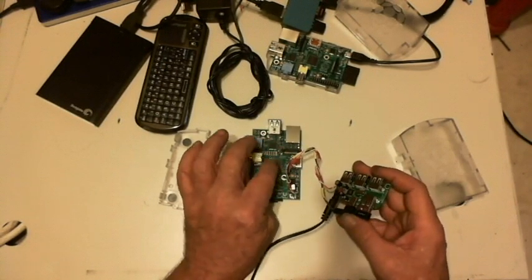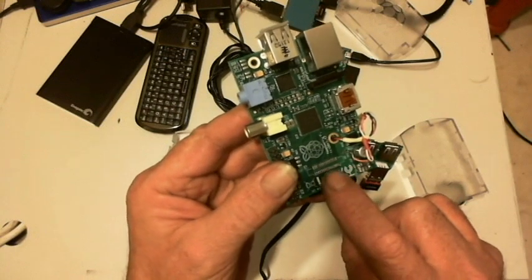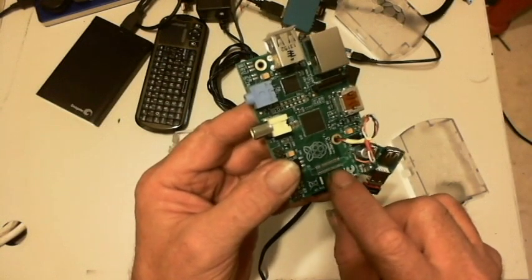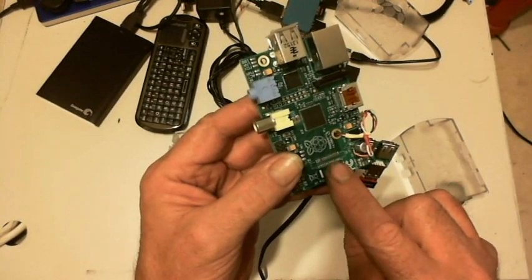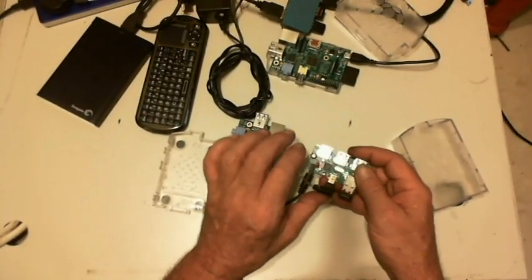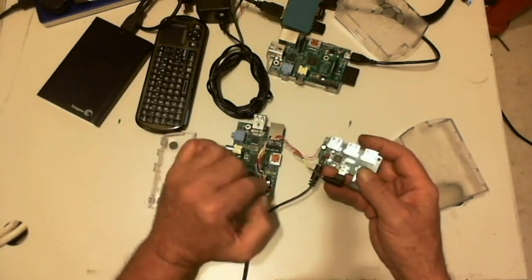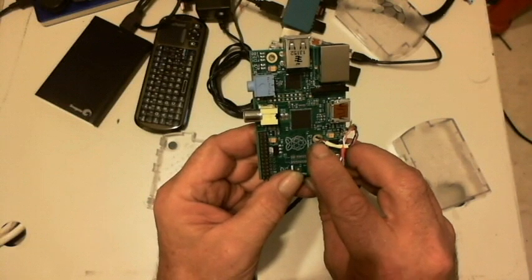I leave enough length in the cord and make it so it coils. When you put these together, it coils up in between there. In order to have plenty of space to do that, I remove the ribbon cable connector, which I'll never use — just making sure none of the solder points are connecting each other, that it comes off cleanly. Then, in order to fit it in the case, I had to use a 90-degree mini USB adapter and strip the wire back off it, making sure it's got enough length to coil and run down through that hole, which is a circuit board mounting hole.